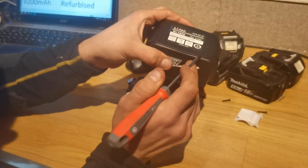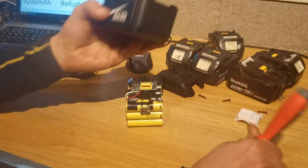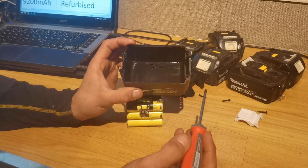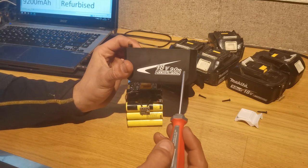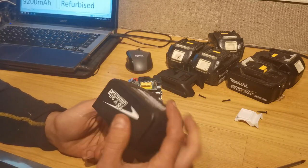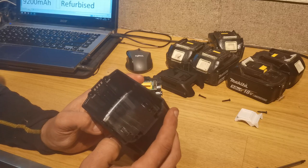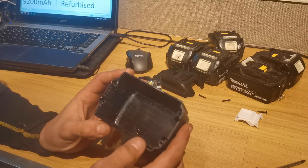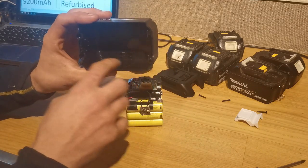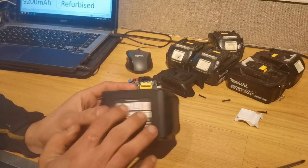Take a knife, put one hole on the bottom, or if you can, drill some tiny holes on the bottom. This will increase your battery life exponentially, because if water gets in, the first level where the water will be drained is around here, so it will short circuit all the batteries. This is bad. This small modification I need to do, because it's not safe. I work in humid conditions, sometimes in rain, in snow, and think of this part. The inside is hot, the outside is cold. Moisture will build up inside here, and it doesn't drain, so this is really bad.